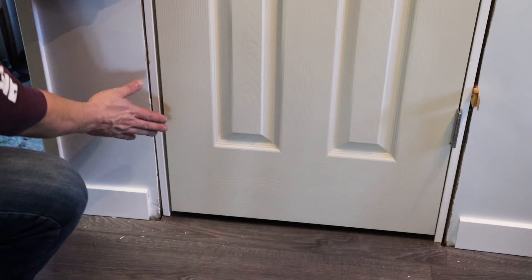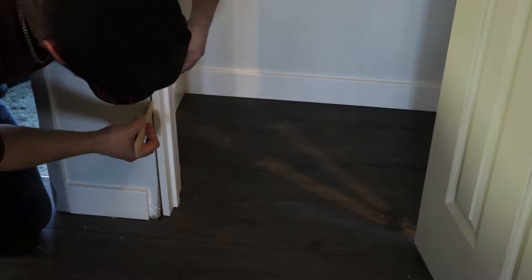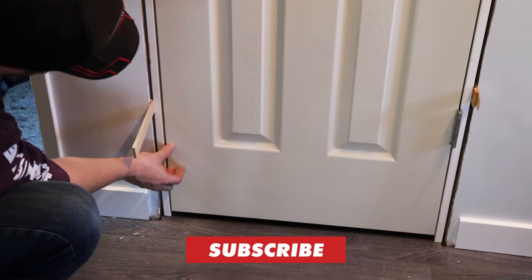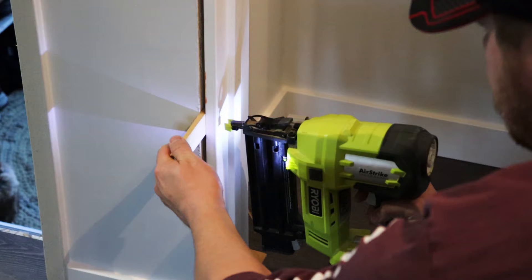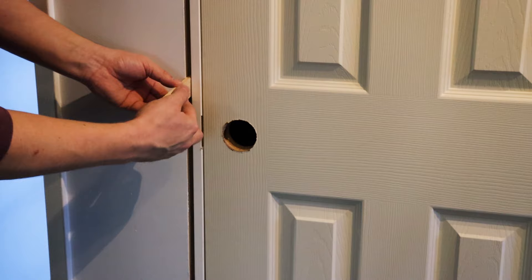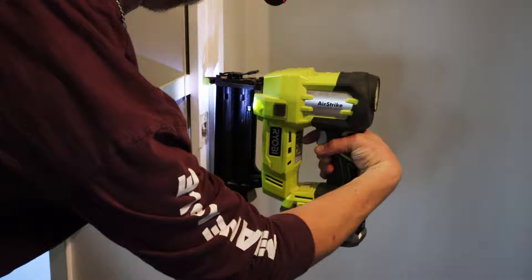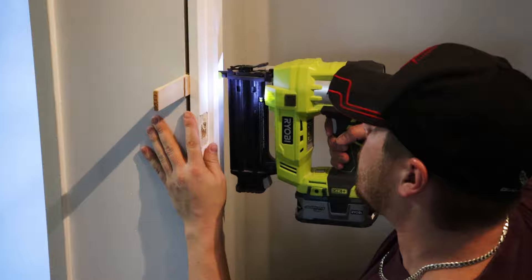If you're building the door on shims rather than actual flooring, adjust the height as necessary. For the bottom side, close the door and put ever so slight pressure against the door frame with the door — that's going to self-align the door frame to the door so when you close it later you have a nice tight fit. Add your shims at about the same height as the other side. I've got a big gap but the bottom is kicked out and rubbing the door — it's a little bit of a twist in my real wood door frame. Easy fix: pull the bottom out and fire a nail through there to hold it away. In the middle above the striker plate I have the opposite problem — I need to open my reveal up, so I pull the door frame out, check my reveal against the door, and once the depth is set, fire a nail through and double check it.